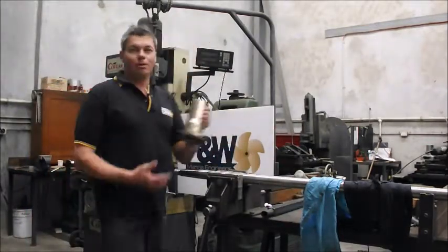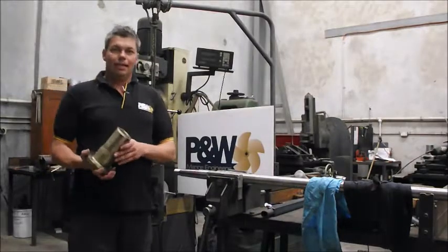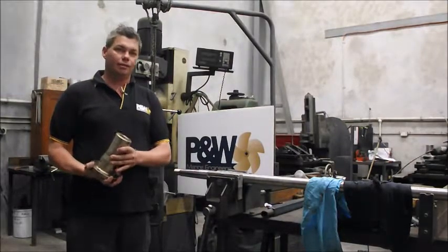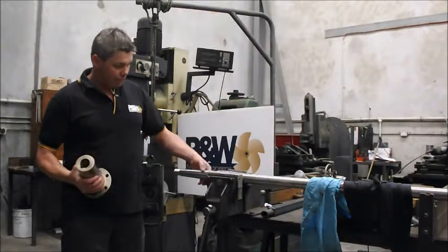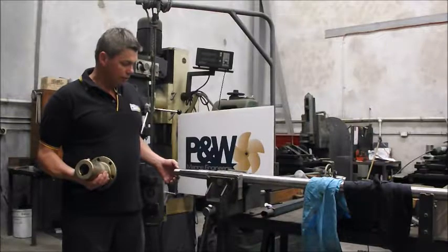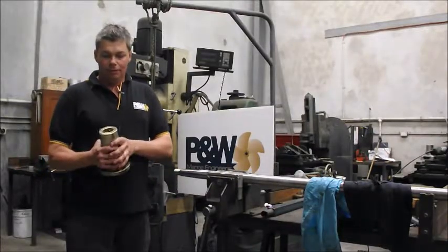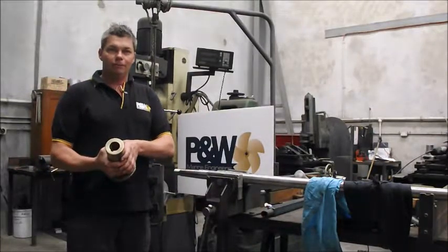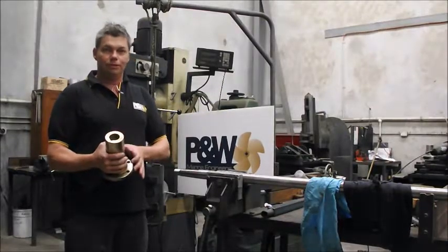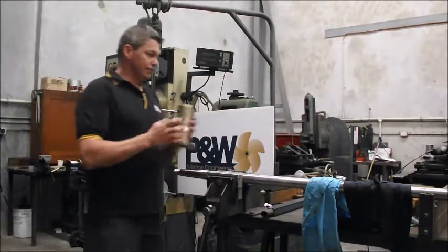It's really important to remember that the key of a coupling is not driving the shaft — it's the taper that drives the shaft. You've got the taper of the shaft here and the coupling is locked on by the coupling nut. I'm going to show you a fit of a coupling so you can see what I'm talking about when it comes to fitting the coupling up properly.